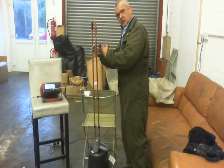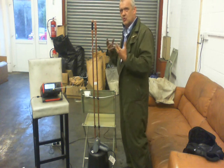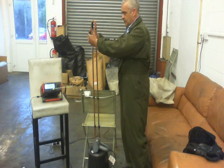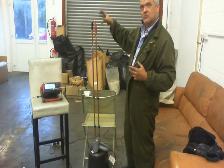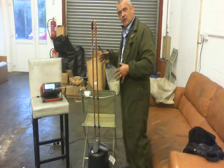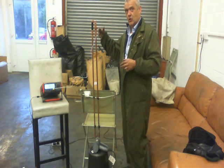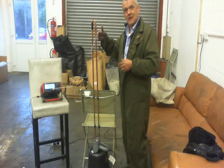Once the water pipe got heated up and it was going, because we've got both pipes just sitting in the air — not heating anything or connected to a heat sink — this one reached the same final temperature as the thermal fluid pipe, but it reached it much more slowly. So if we had a heat store connected and running this system, what that means is we'd be able to heat up twice as much water as we could without the thermal fluid.